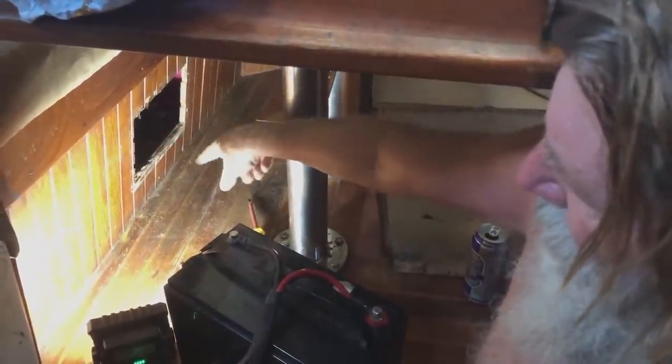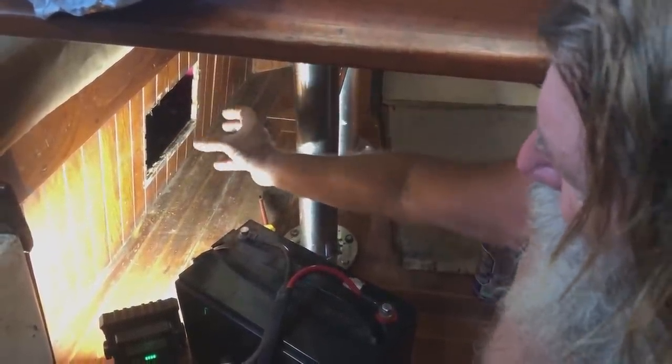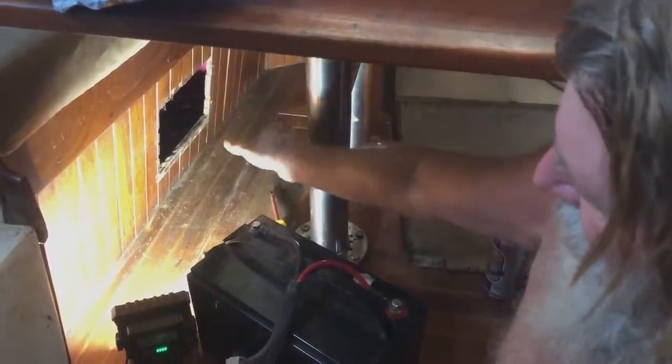What's that big hole, babe? Here? That's where this cabin heater used to be. But the cabin heater only works from engine hot water, and when the engine's running, the cabin's warm anyway. And it's 110 volts. So the last thing we ever need is a heater. That way I can put a nice teak grille on here, with two computer fans behind it, and suck the hot air out of there constantly, pulling cooler air up out of the bilge into that area for both the water maker and the fridge.